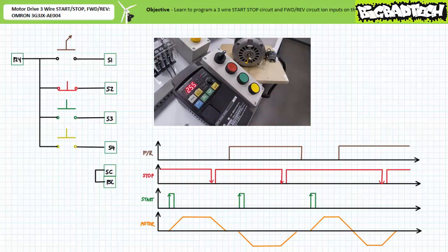Navigate to communication parameter C001 multi-function input one selection, press Mode, decrement this to 22 three-wire forward/reverse selection, and press Enter to save it. Given the selector switch is in the center deactivated position, forward mode is asserted as expected. When an operator presses and releases the start button on input three, the motor drive increases applied voltage and excitation frequency in the forward direction. The three-wire start function maintains the last asserted state and continues to operate in constant speed mode. When an operator presses and releases stop on input two, the motor drive decreases applied voltage and excitation frequency, and the motor decelerates and turns off.